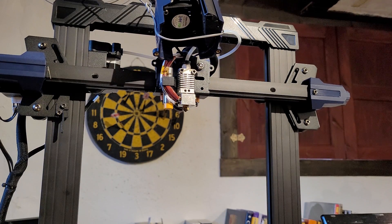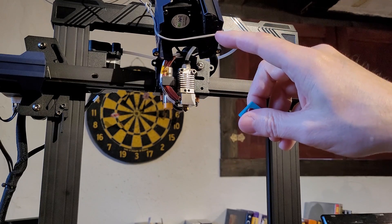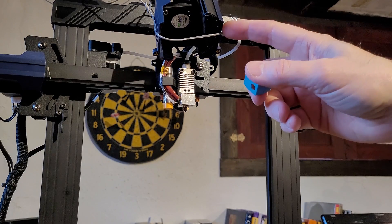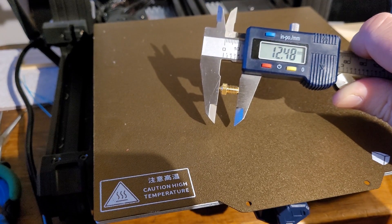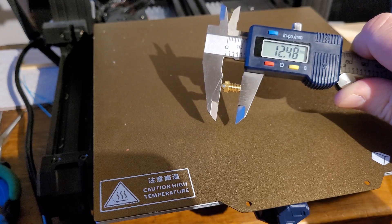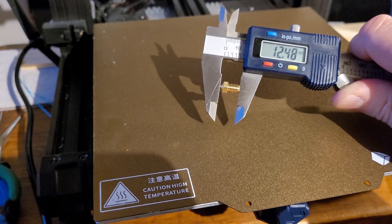Once the unit has cooled down, before putting the cover back on, put the silicone sock back in place, make sure it's secure, then put the cover back on. The two short screws go up the top, the one long screw goes down the bottom — be careful not to overdo it with the bottom screw, it's only a plastic casing and the screw threads into plastic, so don't strip it. The nozzle is 12.5mm long and, as mentioned, it's an M6 thread. This is the spare 0.4mm nozzle that came with the printer. Thanks for watching.